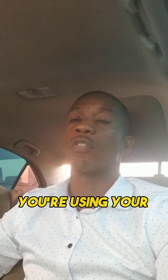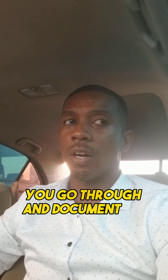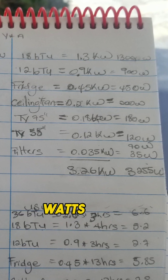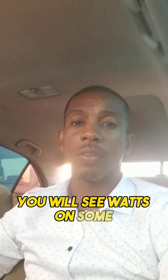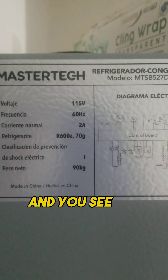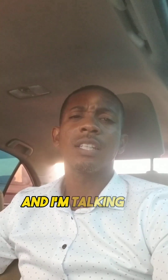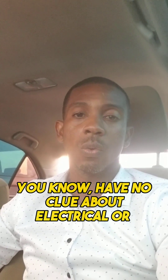So what you will do is go through your house and document everything that you are running in the night that will be using power — your TV, your refrigerator, your iron, your microwave. Go through and document the watts for each one. On some devices you will see watts, on some you may see kW (kilowatts), on some you may see nothing at all. You might see V beside a number and A beside a number — that's voltage and current. Multiply those two numbers together and you will get the watts.